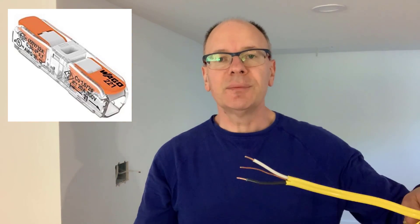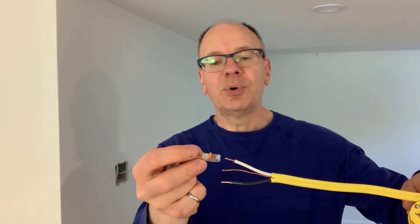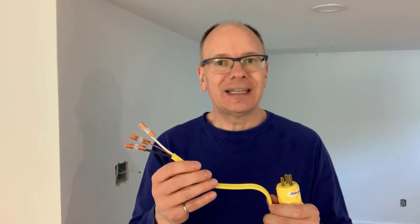I've got my three cables here and these are the inline WAGO connectors — they connect the wire straight through. I'll put one end on: here's the white, I'll put that on, clip it, make sure it's pulled tight. Then I'll do the same for my other two wires — the ground, pull that tight, and the black. I've got this all put back together. By having these three connectors and the plug on the other end, it gives you the ability to power any wire without having that circuit in the box connected to it, because you can plug this into an extension cord connected to a circuit somewhere else in the house that's already turned on. This is a really handy thing to have around — I always keep it in my electrical panel. I've got maybe a couple of feet here, just however long you want to make it.